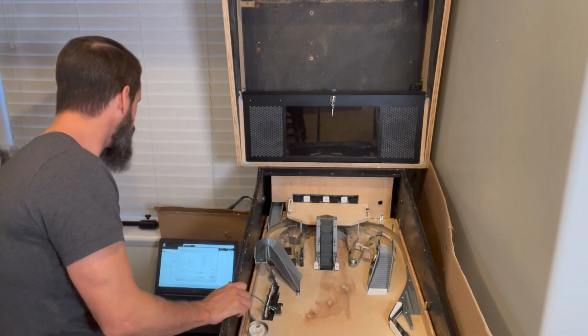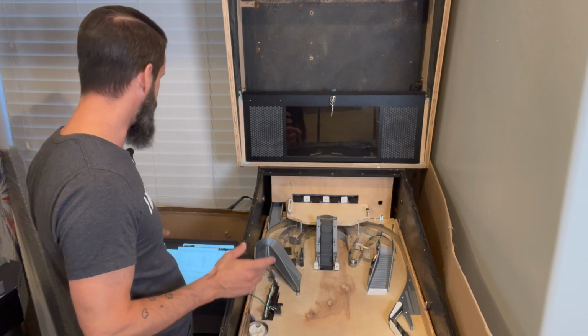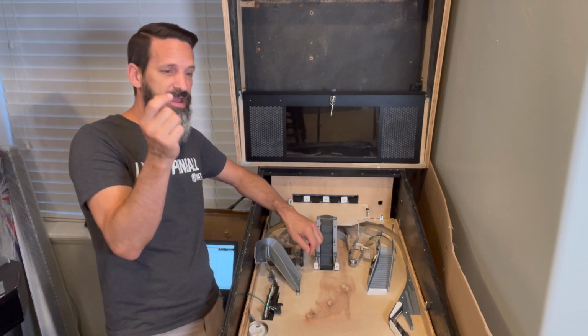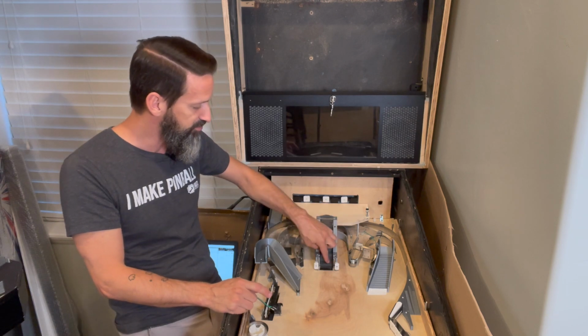So again, if you go back to your Tic Control Center, what I did is I had my stepper motor outside of my machine, just hooked up to my laptop, and I played around with that, and I figured out, okay, how far is a quarter turn? Because for me, a quarter turn is what I need to do to move my staircase up one step.